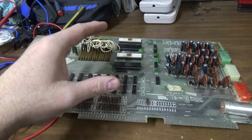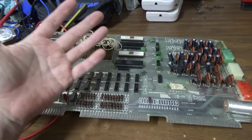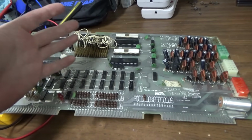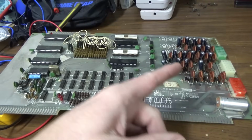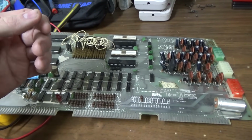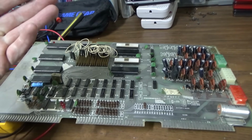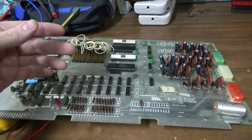And the way they made that work was the games all play the same. They have 5 balls or 3 balls. I don't even know if you can change it to 3 ball on this, but they have 5 balls. You've got an out-hole switch. You've got the runway switch we were talking about. You've got several lamps. You've got several switches. The score things are what they are, so you can make things score 10 points, 100 points, 1,000 points, however you want to do it.